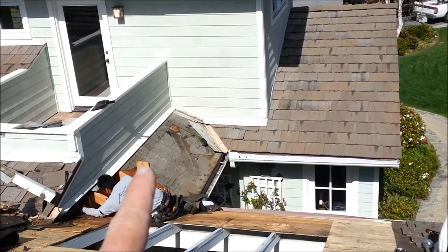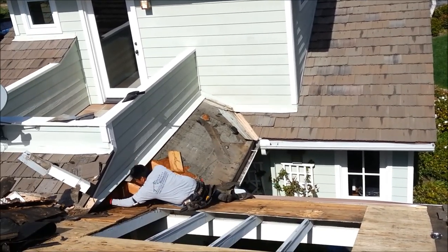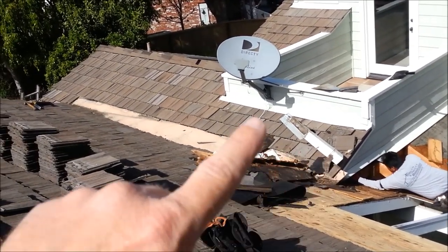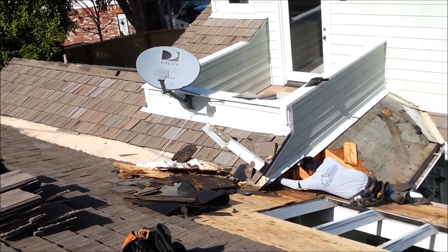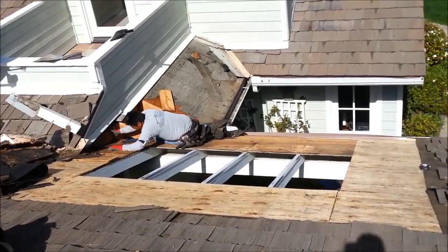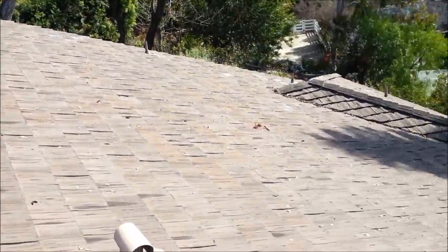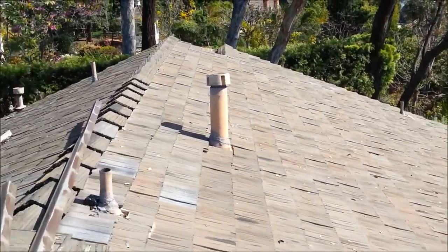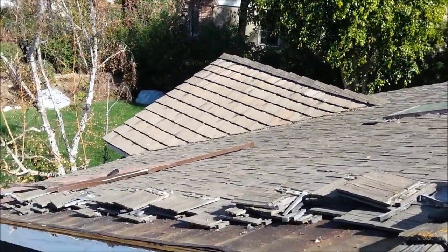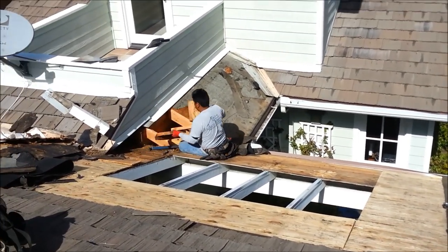Roof we're gonna tear apart all the way over to here. We're gonna go all the way over this corner, so we're gonna redo these two valleys here also as well. And the last thing we're going to do is we're going to redo this whole cricket area for them. And basically, the re-roofing company just fell apart where it took waterproofing skills. They could do some of these big areas pretty well. They're not too complicated. So they were able to do these areas pretty good, not too bad. But right here, they were just lacking in the expertise.